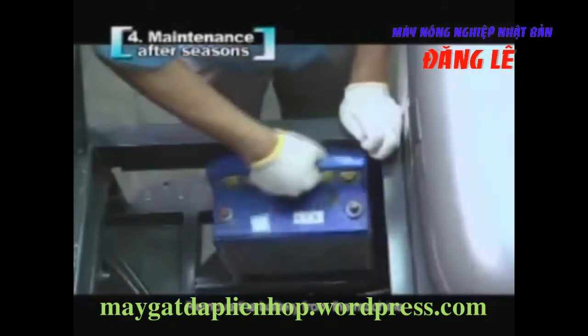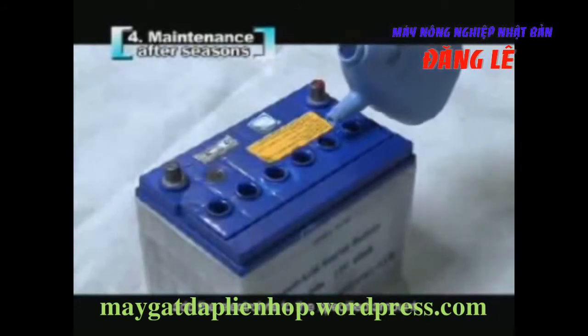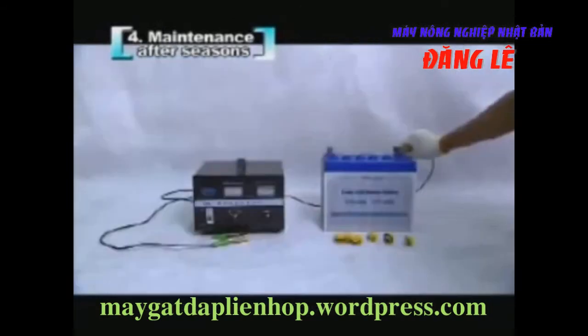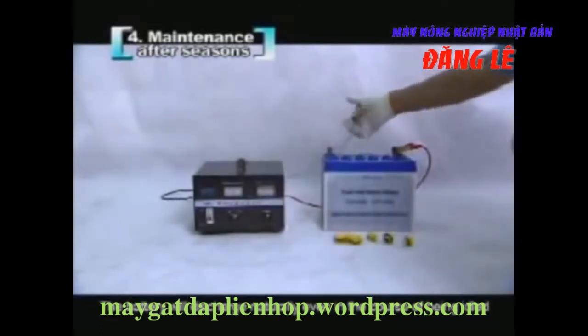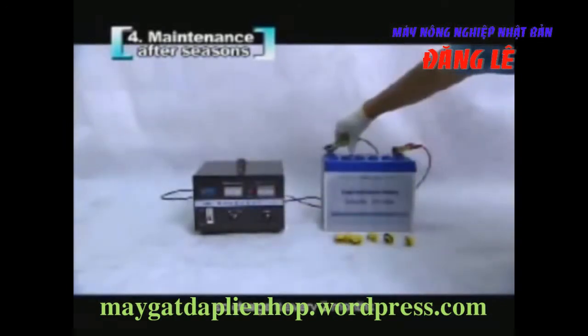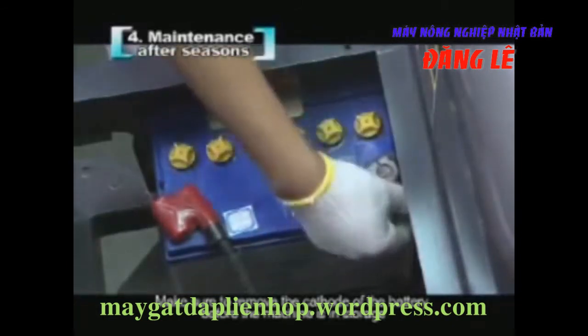Remove the battery from the machine. Add the electrolyte to the specified amount. After charging, put it in a place where the sun cannot directly shine on. The battery will discharge naturally even in the course of being idled, so charge it every 2 months. Make sure to remove the cathode of the battery before the machine is in storage.